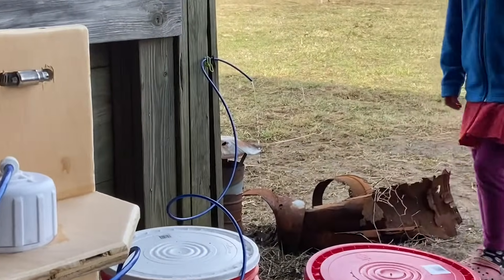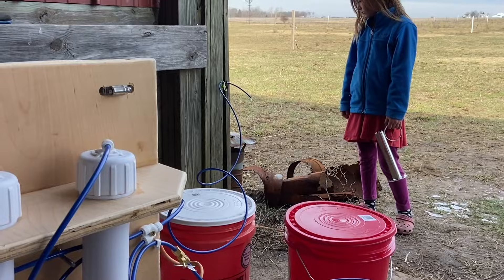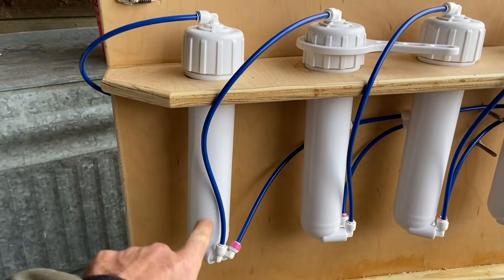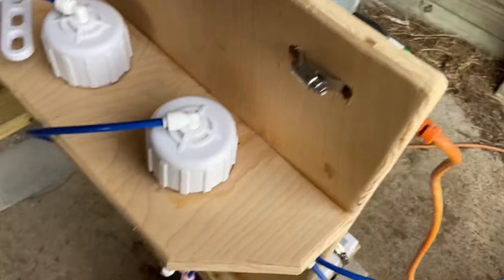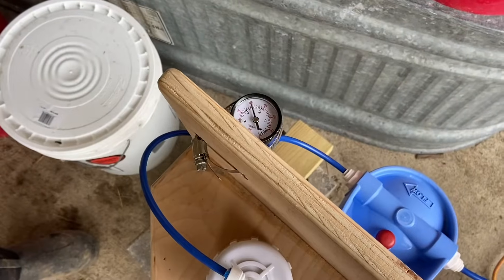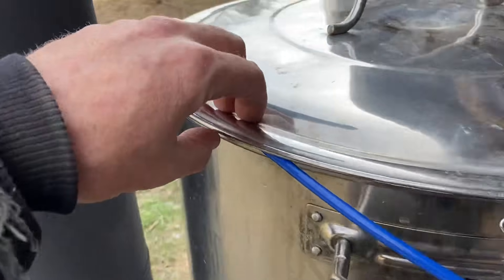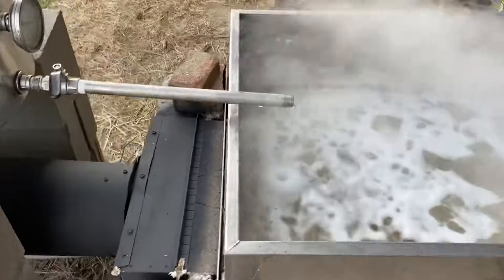This line here is our permeate line — those all tie together and go out where you can see the really purified water. I should probably be collecting that for something, but we have what we need to clean the filters at the end. I take the sap side — the concentrate — and run it into the next filter and all the way down in series. At the end there's a needle valve on the sap line, and that lets you really adjust the pressure. You can see the pressure bounce and different flow rates out of the two hoses. I try to get those hoses at about the same flow rate, flowing into our pre-warmer at about the same rate as we're evaporating.